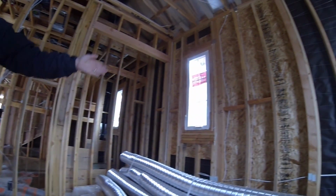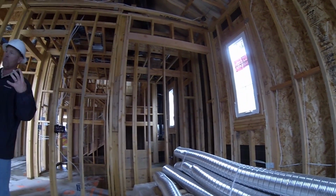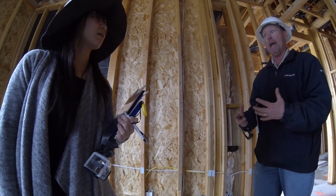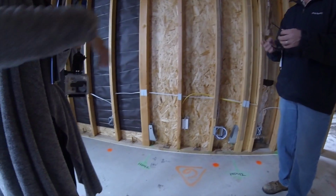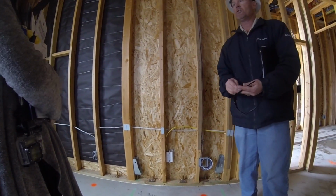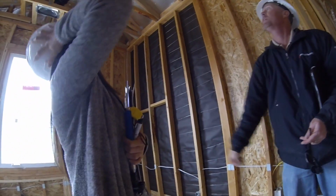So that's the general idea. Plus we're using it to make sure that we give you the absolute most insulated house possible. I actually have a test guy that comes into this house and does a negative air pressure test. He'll seal up everything and try to pull air from the outside in. Based on his readings, he's going to get some air in, and you have to, otherwise you'd suffocate, it would be a safe. But that's how he can test how well insulated the house is, and then he'll give me a certificate for that. So you guys can be pretty well assured this is going to be a very insulated, good energy efficient house.